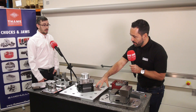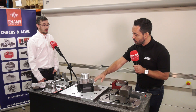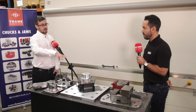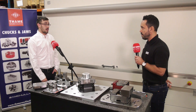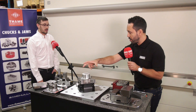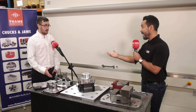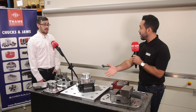The zero point location system underneath this four jaw chuck is also unique. It's a four-position plate where all four positions clamp at the same time using the wedge system. You can move the vices around and all four will give the same gripping capacity. So effectively I could have four centric grippers on here and tighten them all at the same time? Correct. So saving setup time? Saving you time on your machine. Totally unique.